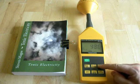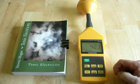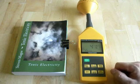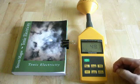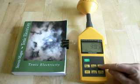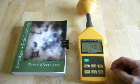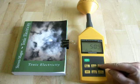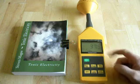You can also record the maximum value — we just switched on max, and the display is now recording the maximum field received in the area. The next setting gives you an averaged value, which filters out any spikes that may upset the reading. And then we have a max average, which is a very smooth version of the average that eliminates many of the spikes. If you hold the button, it turns off those settings and we're back to the instantaneous values.